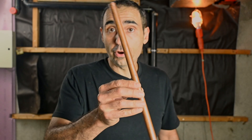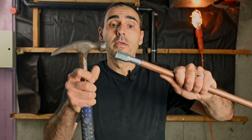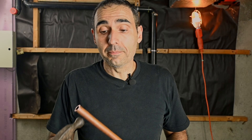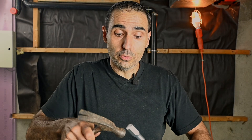We've swaged soft annealed copper piping. One of the big questions is: can you swage hard-drawn copper pipe? Technically, yes. But unless you treat it a certain way, you're going to have a tough time, because hard-drawn copper piping is tempered to be very rigid and difficult to bend. So we're going to need to treat it with some excessive heat in order to soften it — effectively changing the temper — so that we can swage. You also run the risk of ripping the pipe if it's not made to accommodate the stretching.